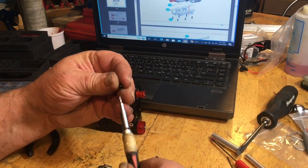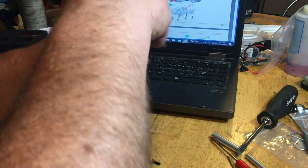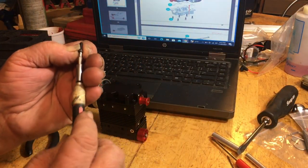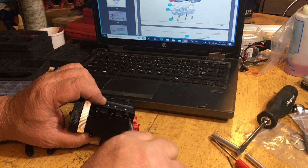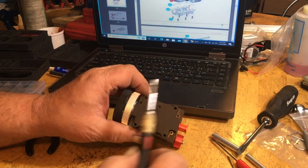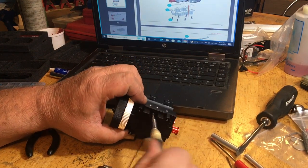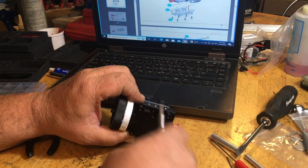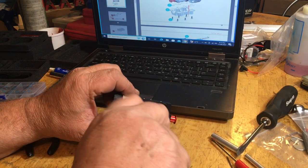Now, the gasket they give you looks like a Teflon style gasket. So I didn't put any grease or nothing on it because it has a lot of thickness to it. So when you tighten it down, it'll actually squish out and seal off everything. Now, there's no way to torque these bolts correctly. So what I usually do is I start in the center here, one here, like so, give it a little twist after I snug them down. Then I'll go to the opposite corner here.